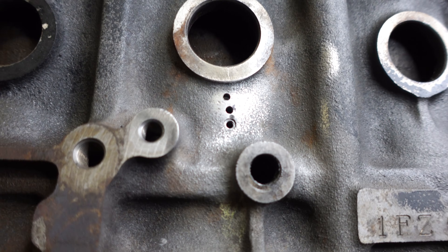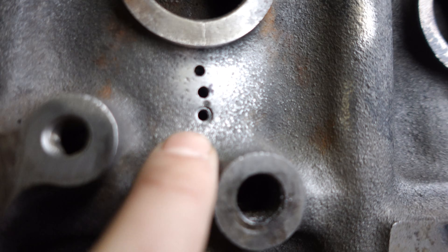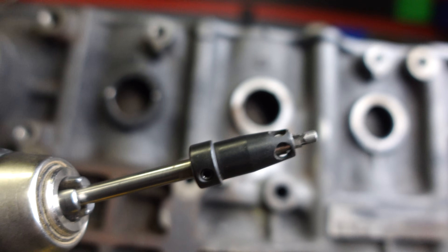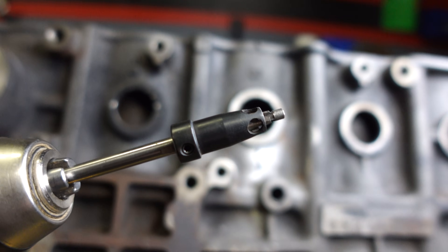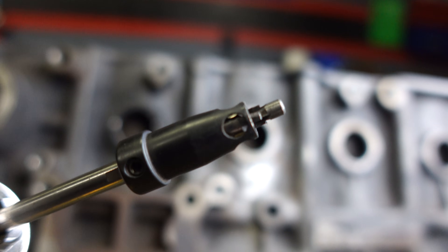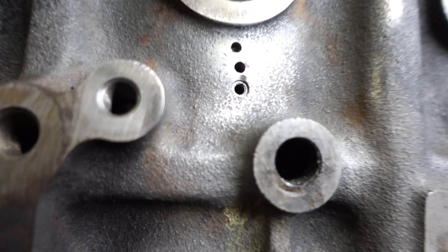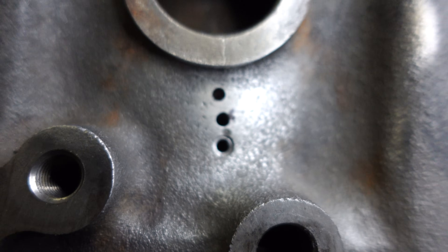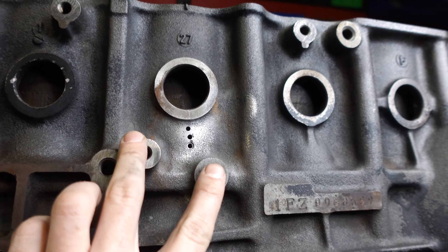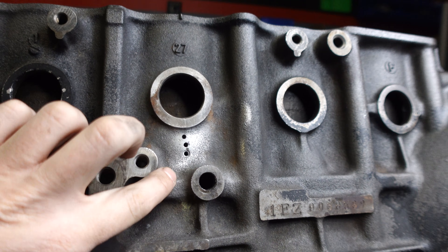There's no turning back now — we have three holes drilled in the block. I used the spacing jig to do that, and as you can see right here I have one of the holes spot faced. Essentially spot facing is a way to give that bolt hole a shoulder. This tool does two things: it creates a shoulder in the stitching pin hole, and it gives a relief for the first thread, since apparently the stitching pin can spread the crack — and that's going to keep it from doing that. Now I'm going to spot face the other holes, get them threaded, and get the stitching pins installed.